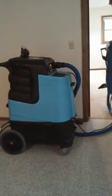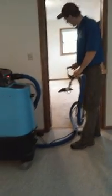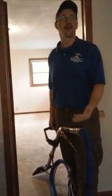You can actually take it, and after a pre-sprayed room, you turn on the pump, hold it up off the ground, and just click the trigger, and then it'll show up at just under 400. And then it will drop down that little bit once you shut it off, but it'll go up to wherever it is at that. And you want to be very careful of that because at 1200 psi, you'll become Zorro in the carpet and you'll have to replace it. So be very, very careful on shooting that through. Plus, the tips on this aren't rated for 1200 psi.